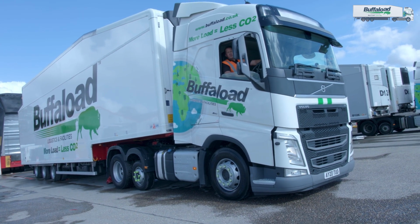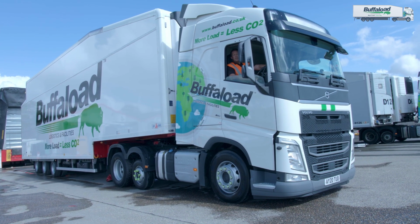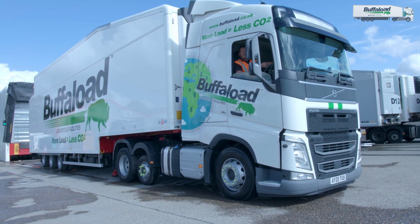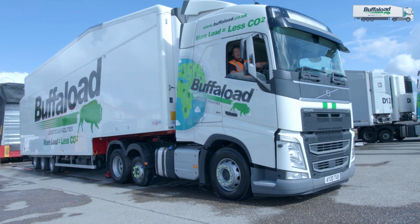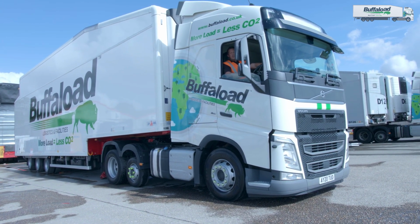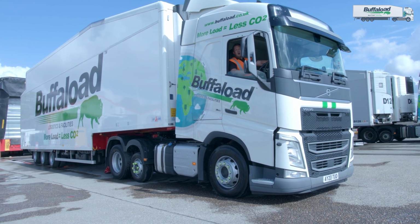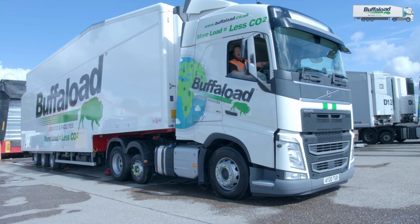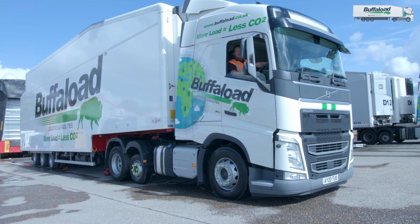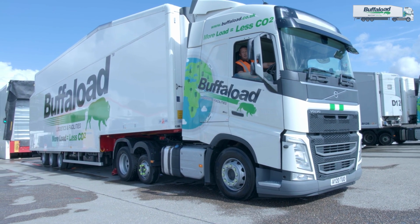Okay, I've now felt the fifth wheel engage with the kingpin, and just to be certain that everything is secure, I'm going to do the tug test, and I'm going to do this twice. The reason I do this is to ensure that the pin is fully engaged on the fifth wheel with the kingpin. If it's not, then I will drive forward. If it is, then the trailer should hold me in position and the cab should try to drive forward, and I will feel the cab raise. I'm going to do that now.